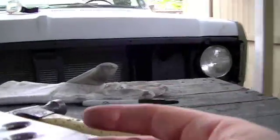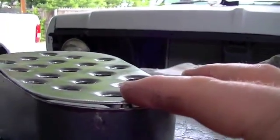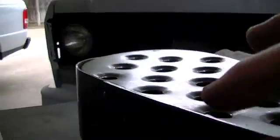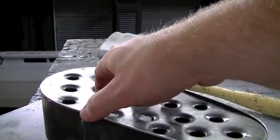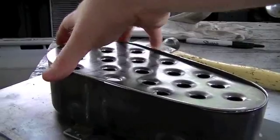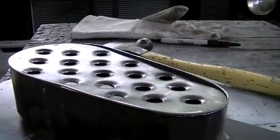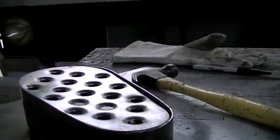You can see right in this area there's a big gap. Basically what I'm going to do is come in here, put a tack weld, push it down, put another tack weld, and just kind of work my way around until this cover piece has good perimeter contact with the outer shroud. I'll get the welder started and get you guys set up on the tripod.